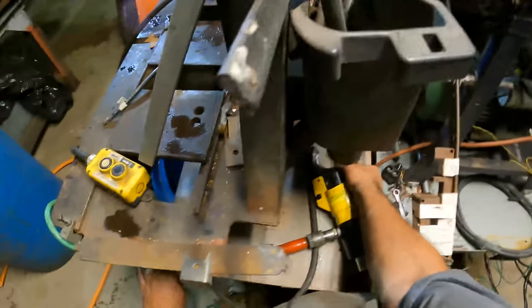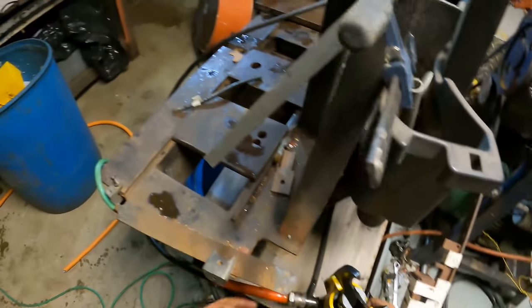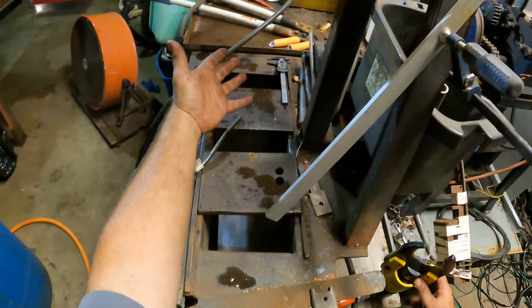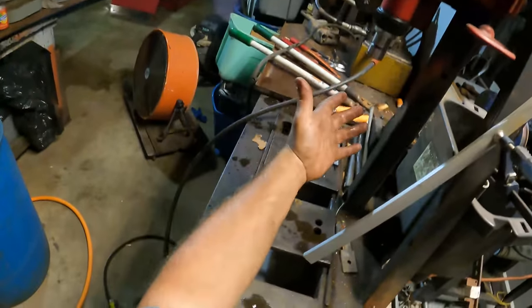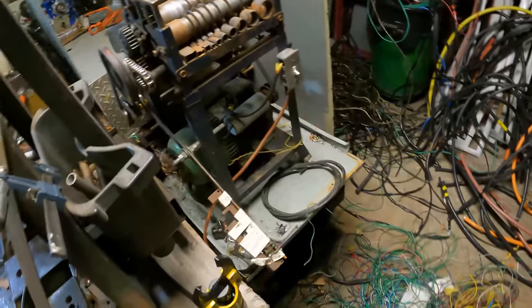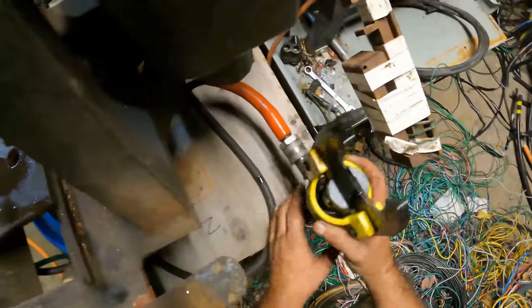I just bought this. I think it was 150 bucks, so maybe it wasn't so cheap, but for 150 bucks, I think I spent $79 or $80 for those Greenlees. So this here wasn't too far off, and obviously you're gonna have to spend some money on a hydraulic power unit. They make a little hand pump for these. If you're on a job site and you're cutting giant 750 kcmil or MCM cables, a little hand pump probably wouldn't be too bad with this thing.